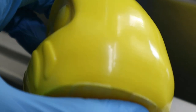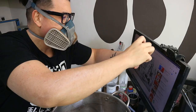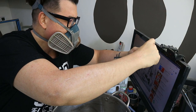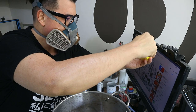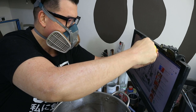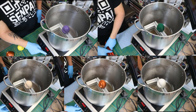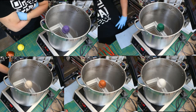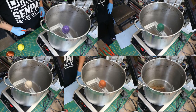This hardening out goes pretty fast as the exposure to the acetone was intense but short. So what remains on the print evaporates pretty quickly as well. I let it sit for 30 minutes just to be sure it was safe to touch without leaving fingerprints on it. As you can see it's a pretty glossy shine after just those two minutes, with a lot of the layer lines smoothed. Here I'm performing a fingernail test on an unsmoothed one. I did the same treatment for all the other prints under the same conditions, timelapsing and grouping these together to save time.